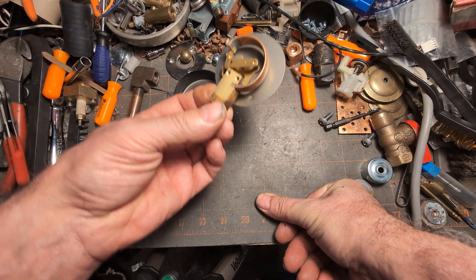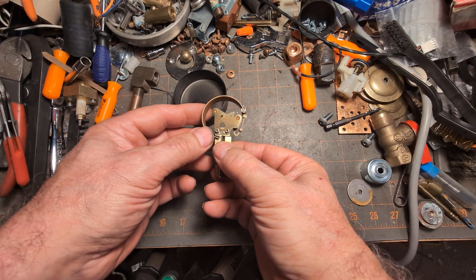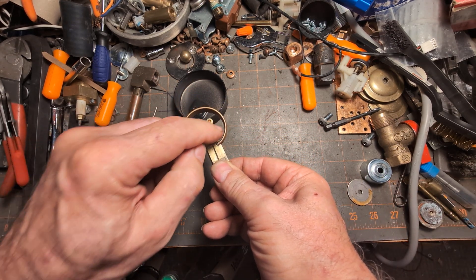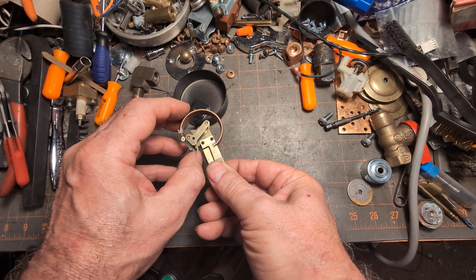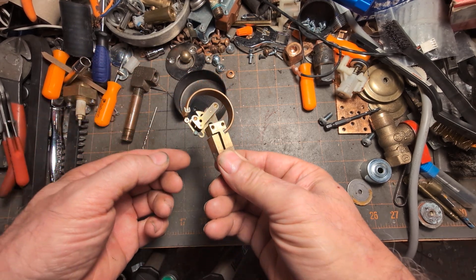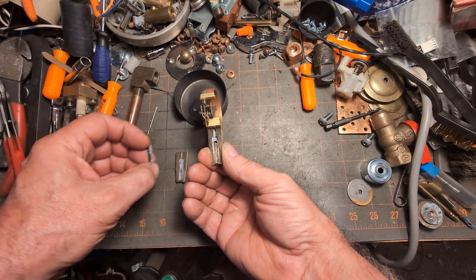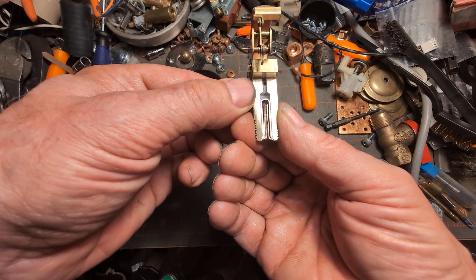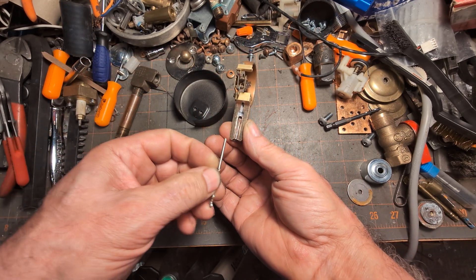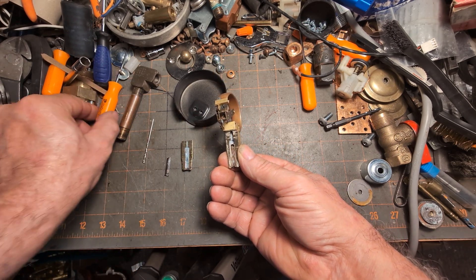Let's cut one of these open and see what's inside. This is the one supposedly labeled 'internal siphon.' There's the Bourdon tube, there's the linkage — they all have that linkage, and they all have the sectional gearing, watch spring, and pointer. We've cut it open and this is what we see inside — fairly complex. We have a smaller tube, and this is where the steam can enter up here. It's open at the end.